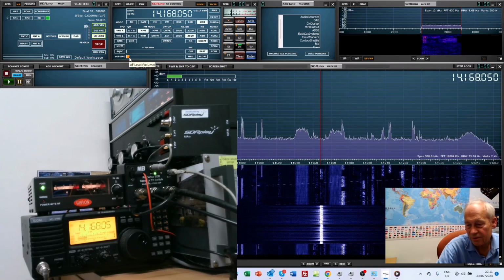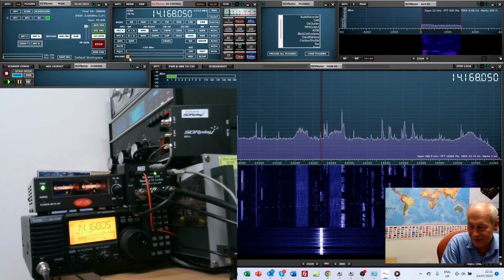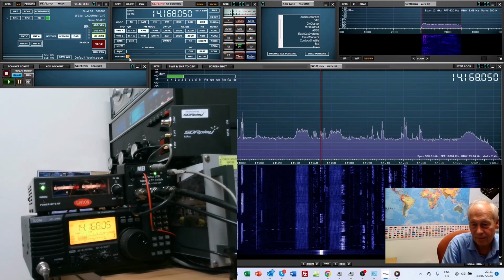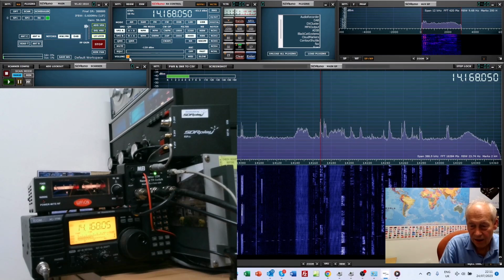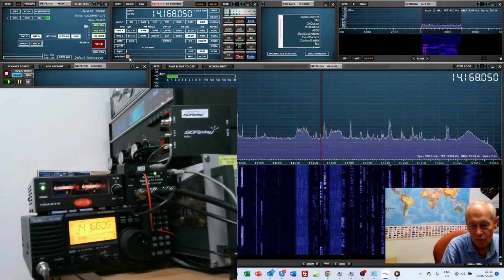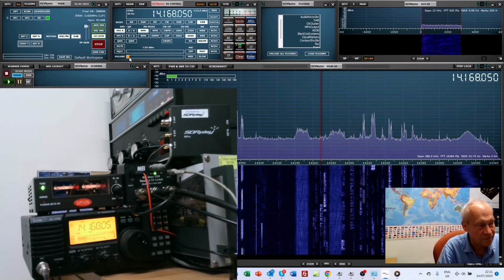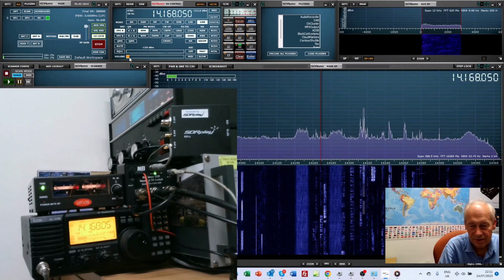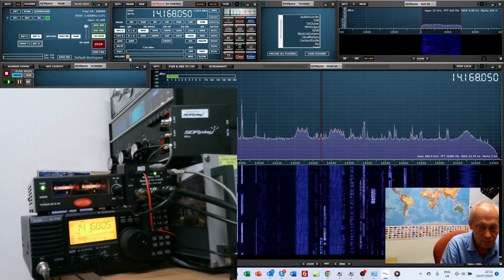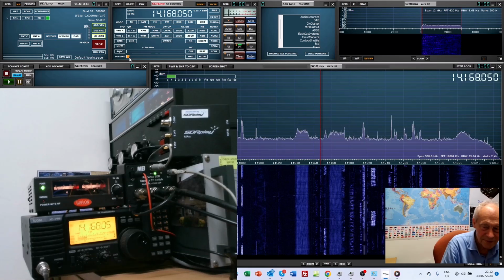So that was great. That was, like I said, the second QSO here with this new fantastic setup with my RSPdx for my spectrum display, and there we are doing some nice DX. I should mention I was running 400 watts through the linear, which is all being controlled nicely by the TR switch, and I'm using a G5RV up about 20 meters at the center. So that's the setup, and thank you very much for seeing my journey today as I finally get round to using an RSP as a Panadapter.